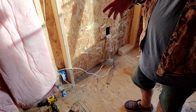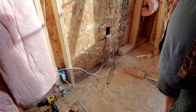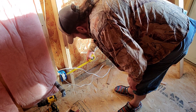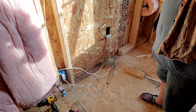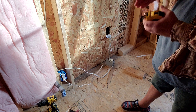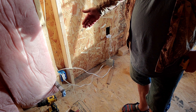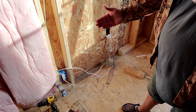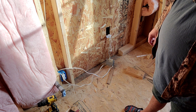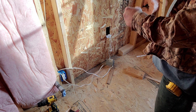I did go ahead and replace the board that my receptacle box was on. By the time I'm done, if I use 2, 2.5, it's going to be 3.5 inches from there to there. We may have to figure out something with that plug, because by the time I add my wall or my door frame in - which is roughly 3.25 inches - that's going to make that just really close to that plug, and I don't like that. I think I need to knock that board back out and redo that.